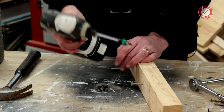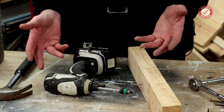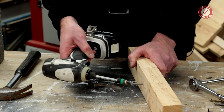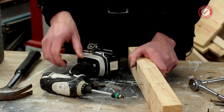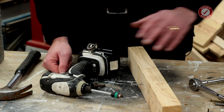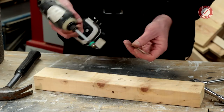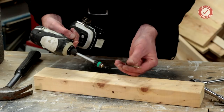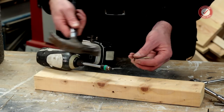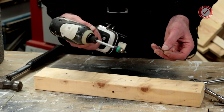My preference is to have all three of these. In an average UK house you're probably going to have brick walls, a certain amount of wood, and always need an electric screwdriver. So for brick walls it's the SDS drill, for hollow walls and block walls it's the combi drill, and for general purpose screwdriving it's the impact driver. One thing with the impact driver is that you don't have quite the same level of finesse as with the combi drill, because of the way the bit is being hammered around and down into the substrate.